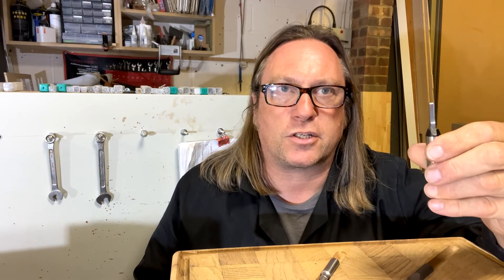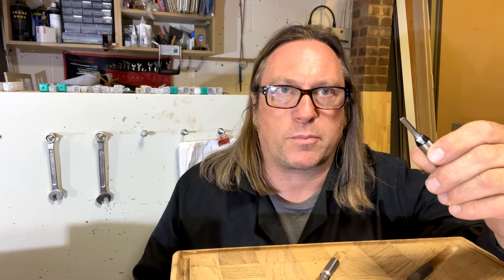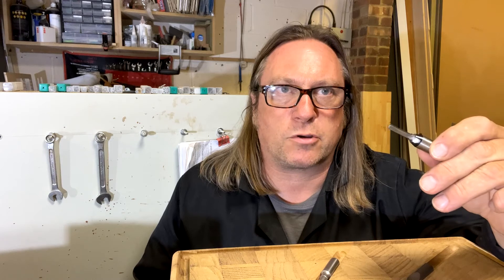The next tool you'll want is for cutting your profiles. This is a plywood cutter — a straight two-fluted solid tungsten carbide cutter. They're around £30, so you won't be heartbroken if you run into a screw. They go about 8 metres a minute and provide a really good finish on plywood. You'll use this for all your cutting-out needs.